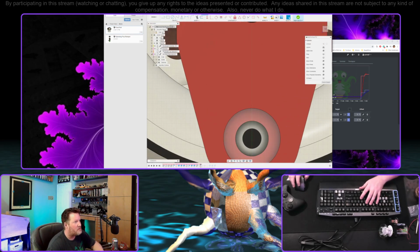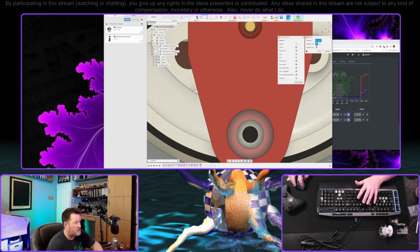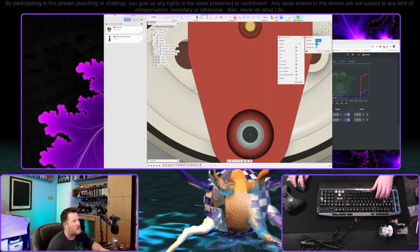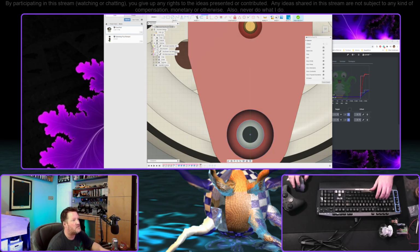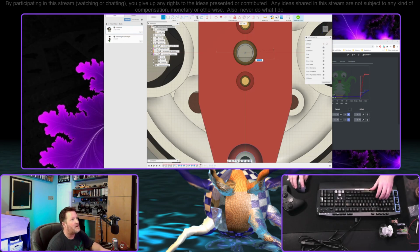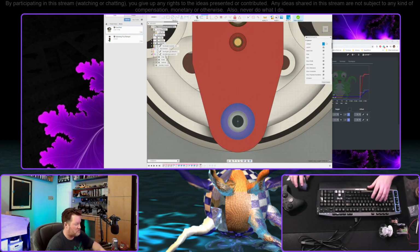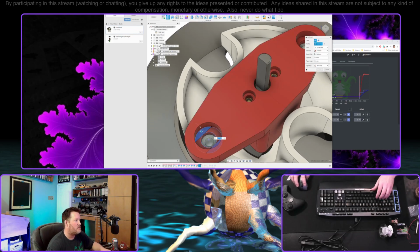But because we have almost no plastic underneath it, I feel like I need to put in a little bit of, this isn't perfect, but we'll give it a little shelf as it's printing, which will make it not print in air, because it doesn't have all that many layers to fix itself before we've gone all the way through the part. So hopefully that'll make a little bit more sense once I put these in. And we want to make those tangents. That bring those up by, I'm probably gonna print this at 0.2, so we'll do that.